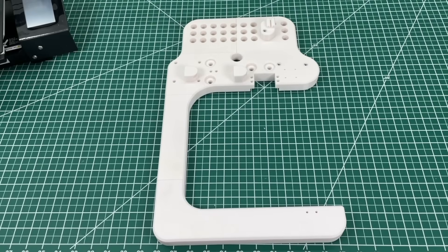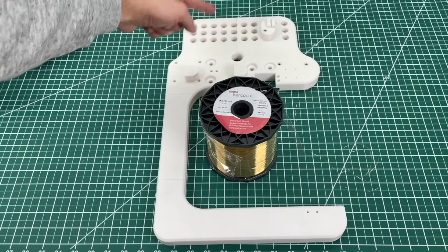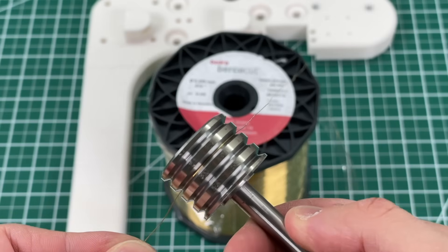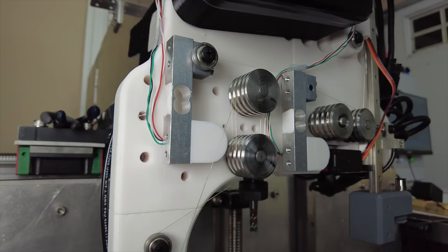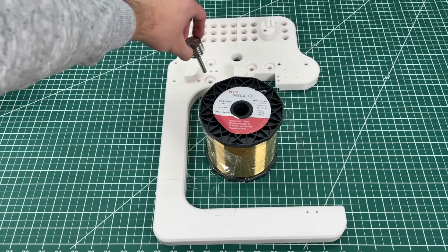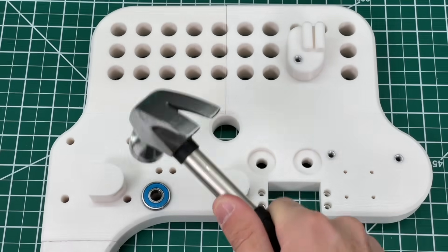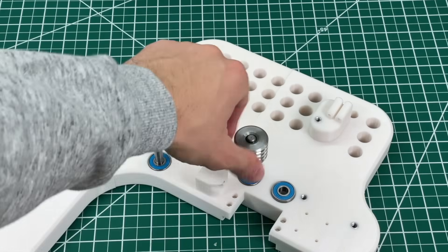We get into the fun part where we begin to work with the brass wire mechanism. This brass wire will travel all across here, so let's start installing the wire guides. Our primary drivers are these special metallic honey dipping sticks. There's actually quite some science that went into conceptualizing these — their primary function is to generate as much contact area as possible with the brass wire in order to prevent any slipping. These mount into two bearings, one on the front and one on the back of the frame. You should probably use a press to fit them, but my hammer did just fine.